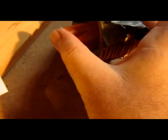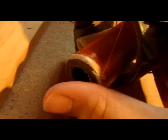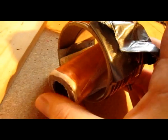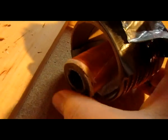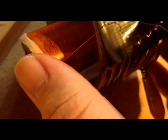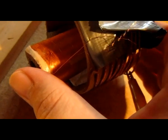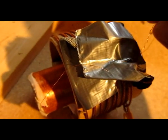It's a very small little coil. The windings on the secondary are just around one of those cardboard tubes you see at the grocery store in the fruit aisle — the ones those plastic bags are on. And it uses some very fine wire off of what I think was a broken relay, probably around 34 gauge, sprayed about two or three times and coated with some enamel.